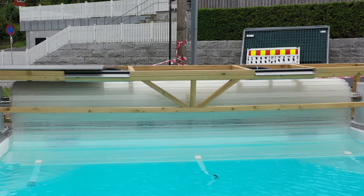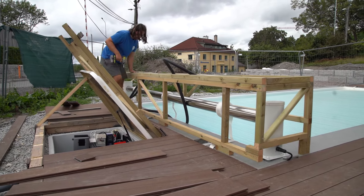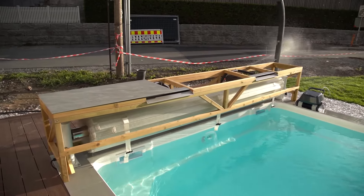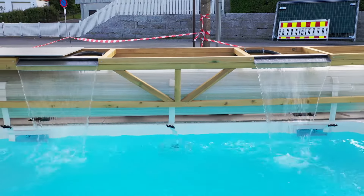You can further customize slats with insulation foam, but since we were looking for a transparent option and insulation was already sufficient for our use, we didn't see the point in increasing the budget. If the rolling kit is installed above the pool, you'll need to protect the slats from heat or you risk deforming them. We solved this by building a protective box that we can also use as a bench, for decoration, or — in this case — as a built-in waterfall.